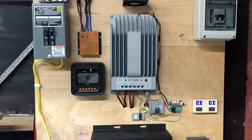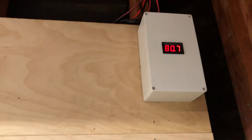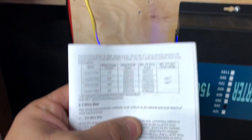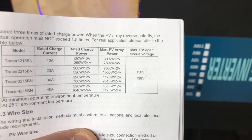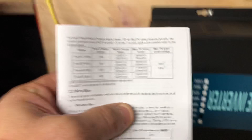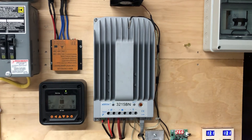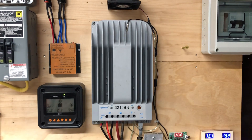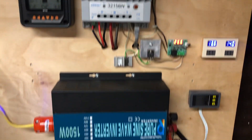I don't see where switching is really going to save anything unless you already have a charge controller that can handle a higher voltage input. I'm at 80 volts coming in right now. On a 12 volt system it says 150 volt max, and on a 24 volt system 138 volt. That's like having two charge controllers — I'm able to double my output on that if I need to. That's the only gain I see switching to 24 volt on my system. On yours, could be different.